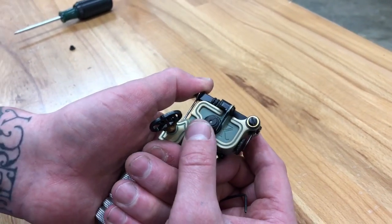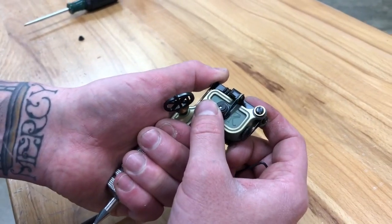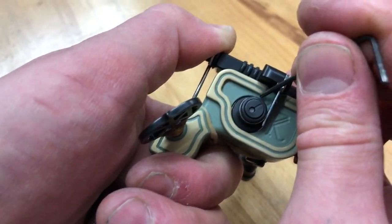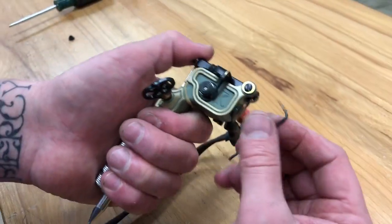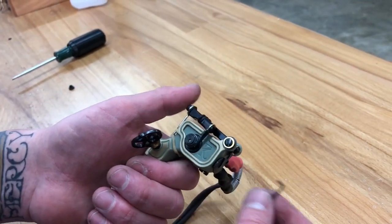With the impact screw, don't ever turn the screw in to where it raises that cam line past the forward line on the frame. If you do, you're going to break your pivot spring. The machine won't run right — the stroke will have to be really short to get it to run correctly.